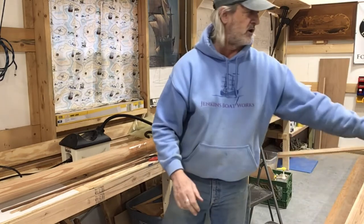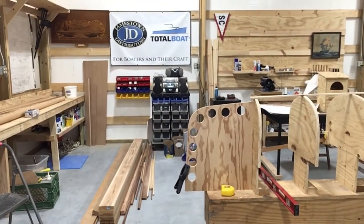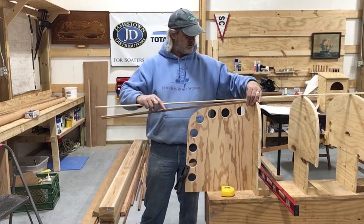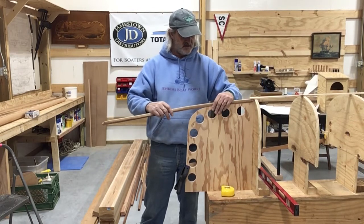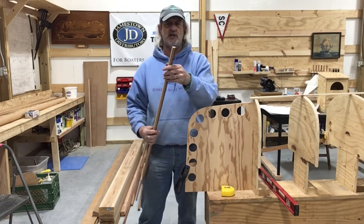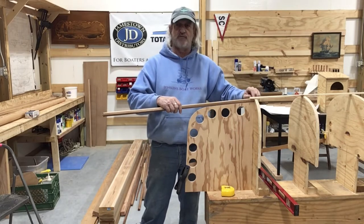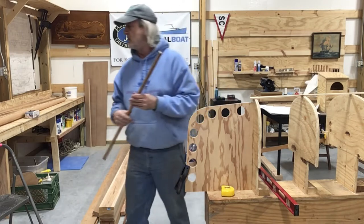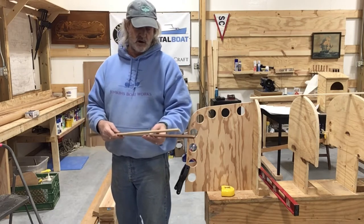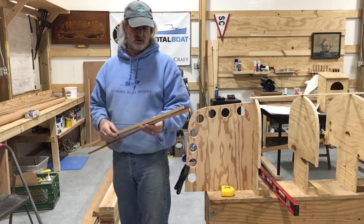They've got to go on the end of the canoe, right there. I'm thinking to bend them like that, put the cedar on the outside — but there's no way to make it around that bend right now, I'd just break them. These are quarter inch thick, so we've got a total of three quarters, which is what the plan calls for. Now I'm going to cut my bag and then we'll steam these. Steaming wood is typically an hour per inch of thickness. These are only a quarter inch, so it should only take about 15 minutes.